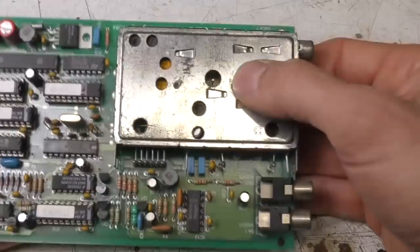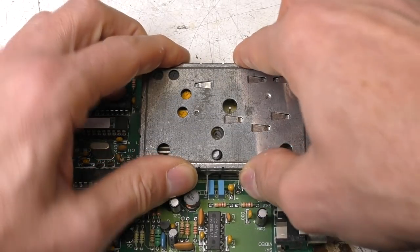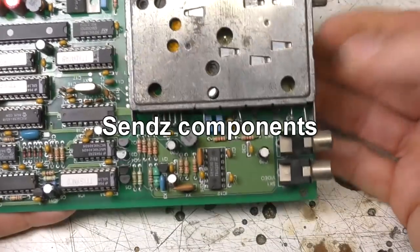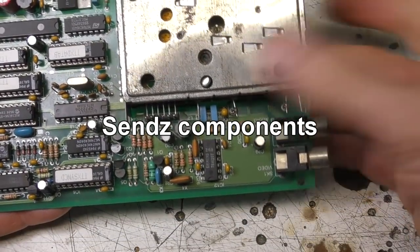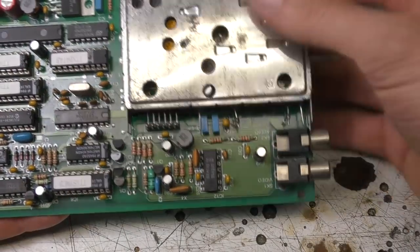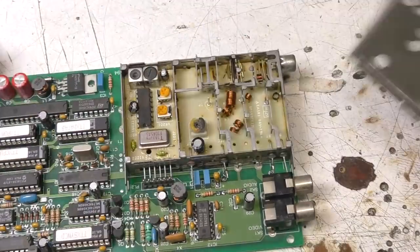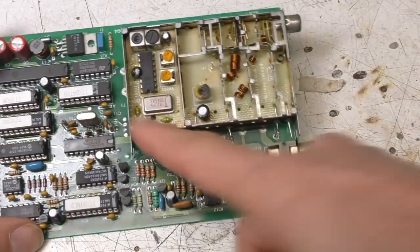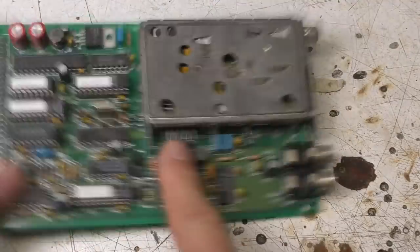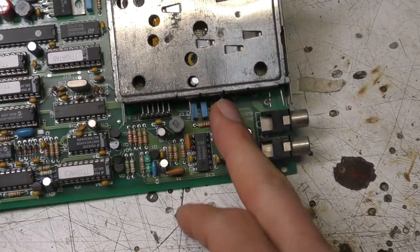So this actually used this tuner. There was a company that specialised in end-of-line surplus components for TVs. I think they're in Southend or somewhere. I don't remember what they were called. And this was a surplus batch of TV tuners, maybe a couple of hundred of them. This was a very standard tuner that you'd find in an analog TV of the era. It just takes the UHF in. This one's using a surface acoustic wave filter, which was pretty much standard in those days, and it produced the video out, and it needed an analog tuning voltage, 0 to about 33 volts.